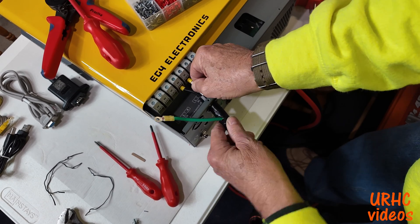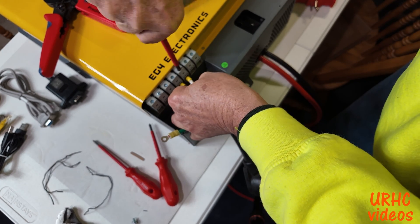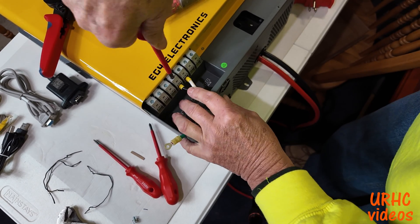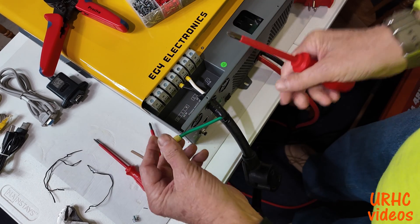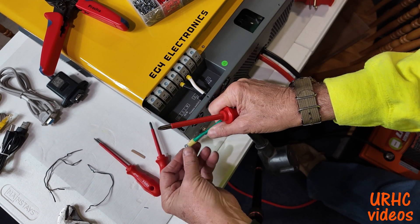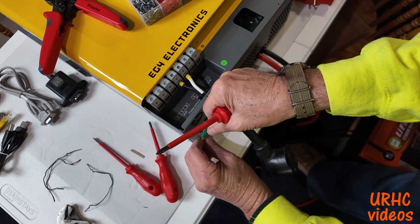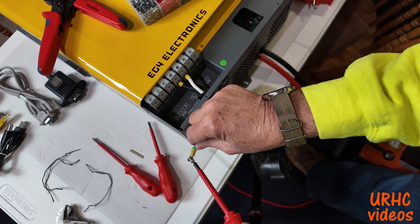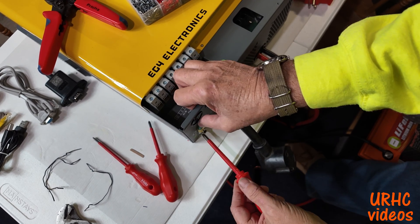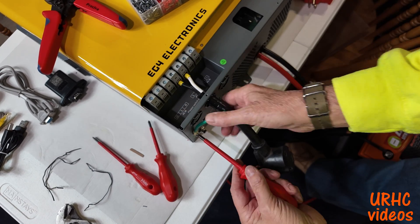You can see the black and white wires go right in there — the plus and the minus — and then the green ground goes to the stud. I left that pulled out of the cable and I'm just going to attach that to the ground screw. After watching some videos, I found out you could also attach it to that other ground lug for the input power, because it's all bonded together to the frame of this unit. But I decided to do it the way the instructions show. This is going to be my temporary AC output, and it will be plugged over into my generator input box. This will take care of the crossover when the batteries go dead.